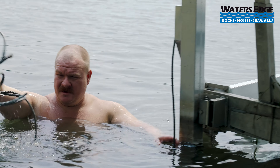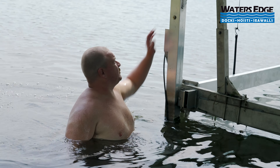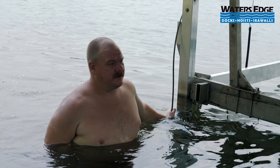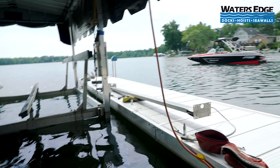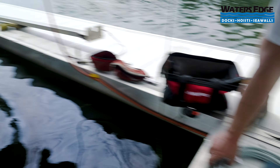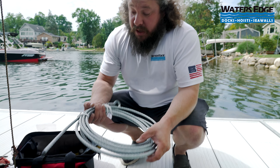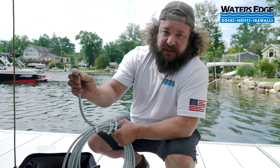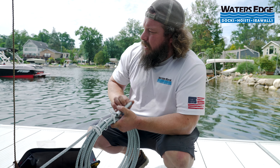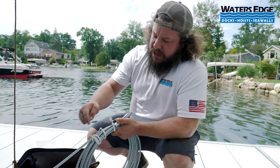Now it's totally out of the cradle. Nate, do you remove that before you run the next one through? If I'm on a time crunch I'll just do that last — you do it in one move, take off, put the new one on. Now the new cable goes through. You're going to usually get a cable that looks something like this. For a lot of lifts it's just a tag end on one side — no connection at all — and then a loop on the other. Some have eye bolts. There are a couple of different types of setups to terminate the cable but this is very typical.